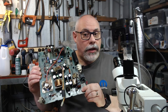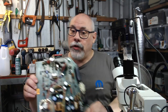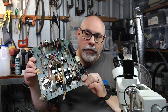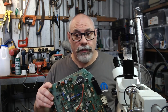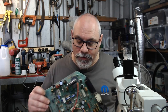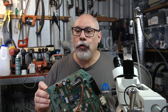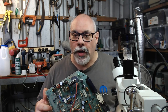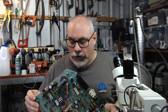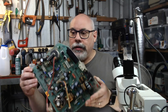And one of the questions I regularly get asked is, can you take a US board and change it into an international, and whether you could take an international and change it into US? With the Mac Plus, 128K, 512K, the short answer is no, not really, not easily. I've never come across someone who has come up with a reasonable way of actually doing that. So that's just how it is. It's different if you're talking about a Classic or a Classic 2, they can be altered, but these, nah.